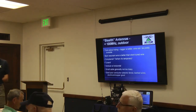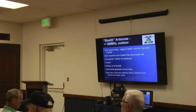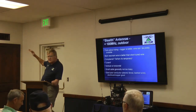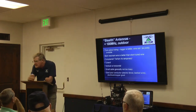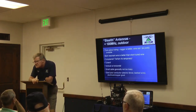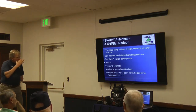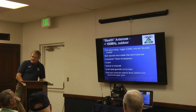Once you start doing the bouncing, doesn't your polarization kind of wash out? It does all sorts of weird stuff, absolutely. So, yeah, the whole point of HF generally is to get ionospheric bending and refraction, and so you're transmitting over the horizon and talking over the horizon, and you're absolutely right. The polarization becomes weird when you start bouncing signals around.